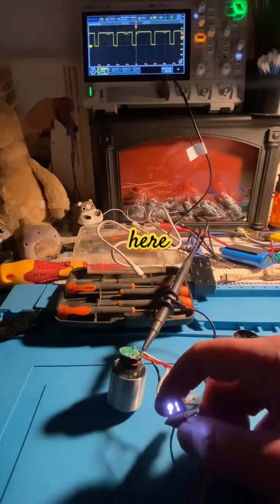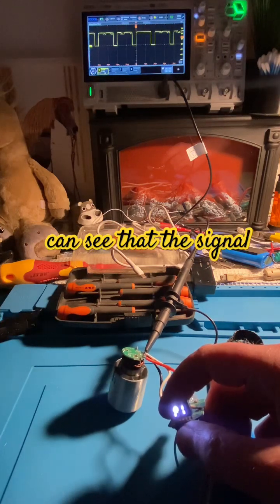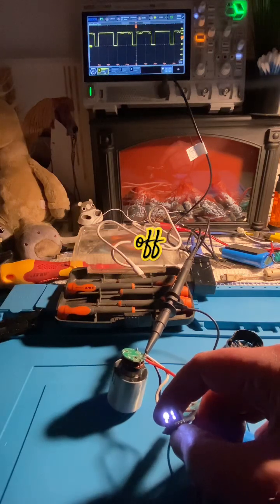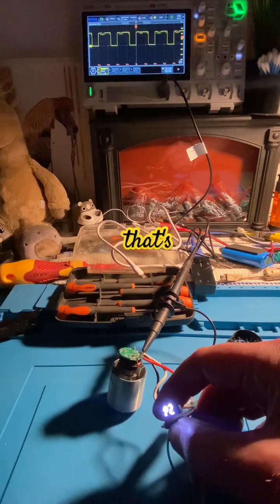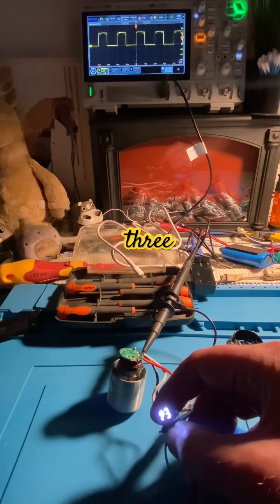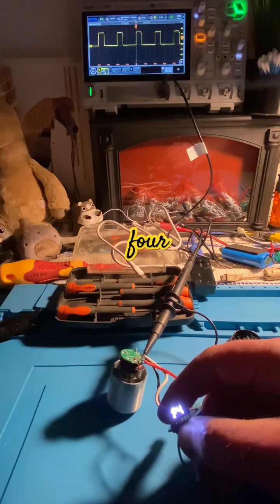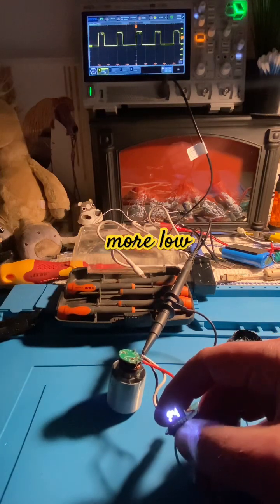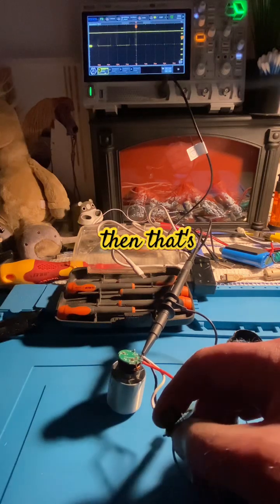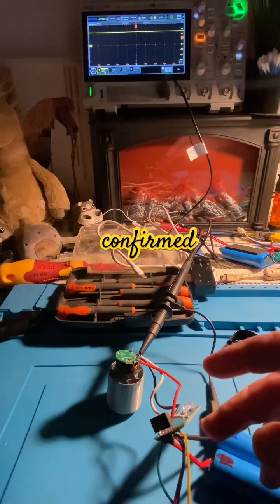Reaching in here, it's P1. You can see that the signal is going low — it's high when it's off. That's number two, a bit more low. Number three, a bit more low. Number four, a bit more low — that's full speed. And then that's off again.